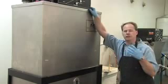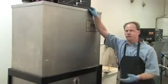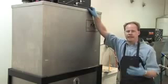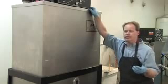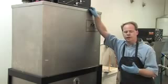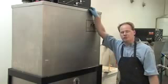That's anything from large dump trucks, big earth movers, to farm equipment, to tiny little TDIs, you name it. If it's got a diesel engine in it and it's direct injected or indirect injected, chances are it'll run on biodiesel. Believe it or not, when Rudolph Diesel made the engine, his goal was to have an engine that was ubiquitous with all sorts of different oils, and biodiesel just happens to be one of those that'll run in it.